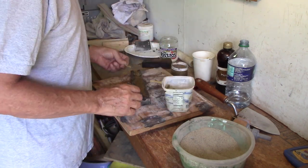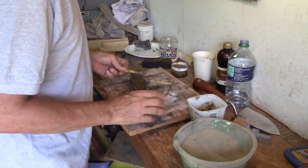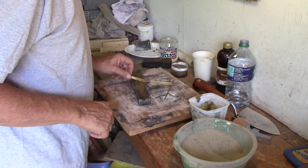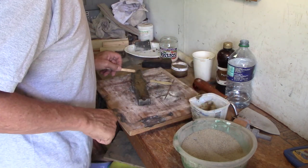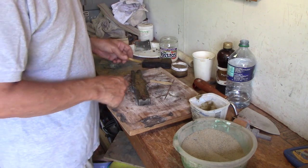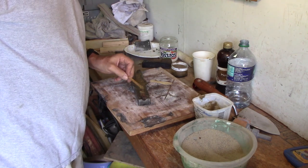You want this core to unbind when your castings have cooled and your parts are out of the sand — you want it to be pretty easy to crumble out. I'll put it in the toaster oven and bake it at about 225 for an hour, or whatever it takes. If you pull it out and you can still see that it's damp, put it back in for another 20 minutes. It'll make your workshop smell nice when you're cooking it — smells like cookies, bacon.